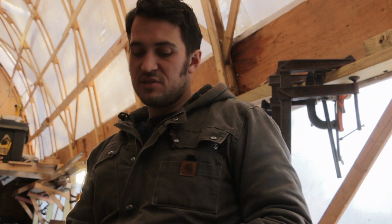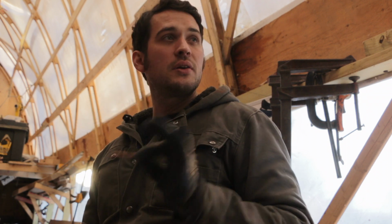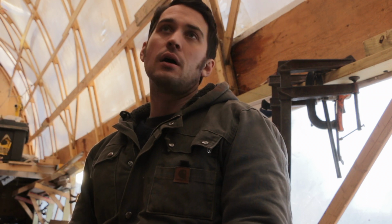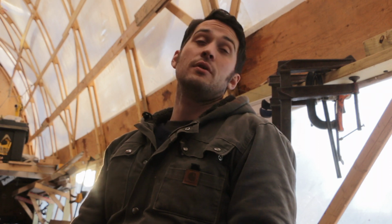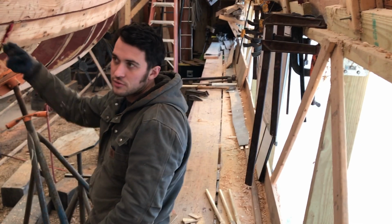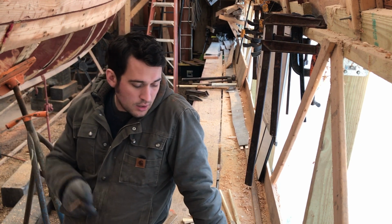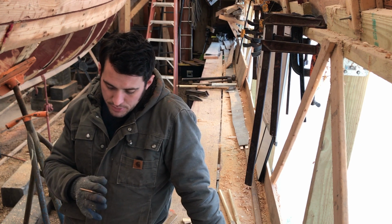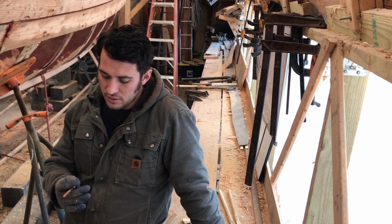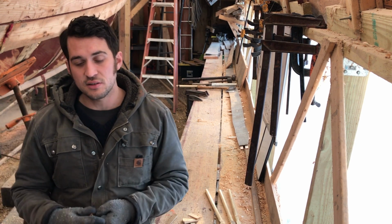And they're pretty good. They're bronze, so they're not cheap, but it's all relative. They're relatively cheap. They are really quite strong, sort of medium to high strong, against extraction loading, which is mostly the forces that are on planks. They have a little bit of shear loading when the boat's moving around a lot, but for the most part, what any plank fastener is doing is trying to stop the plank from coming off, and they're entirely acceptable at that. They're not that great against shear loading.